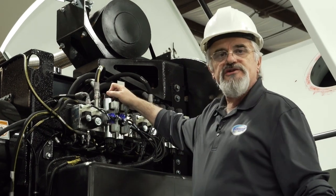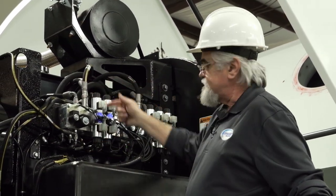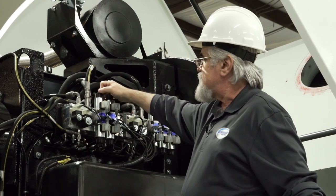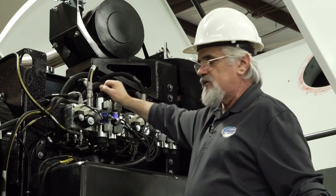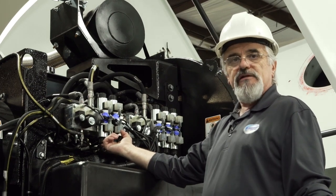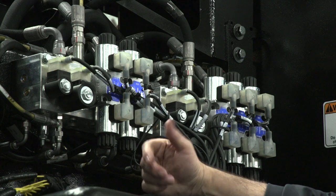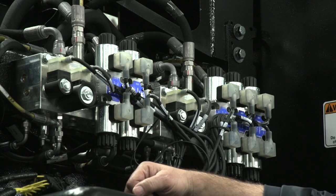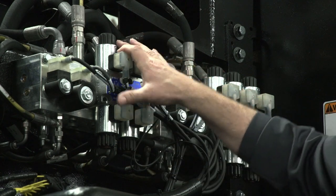There is a way to troubleshoot the directional valve. On either side of the directional valve there is a pin. If your broom is not spinning, not going down, or not lifting up, you can get a small screwdriver, come here, and push that little pin all the way in — make sure it bottoms out all the way. That way you can manually override the valve. If the broom comes up or drops and spins when you push the pin in, that means you do not have a hydraulic issue, you have an electrical issue. If the broom is still not operating after the manual override, then your valve needs to be replaced.